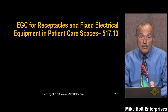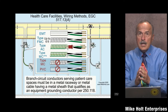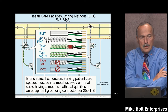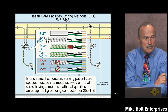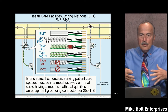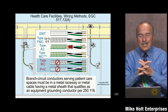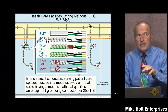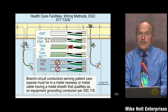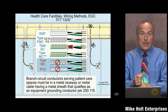We're talking about the equipment grounding conductor for receptacles and fixed equipment in patient care spaces. In a patient care space, you're connecting IVs, TENS machines, doing blood pressure monitoring — in other words, making some kind of electrical connection. So we want to make sure that if there's a fault, we remove that voltage by clearing the fault. We can't take a chance with a single effective ground fault current path like we normally would with Romex or EMT.